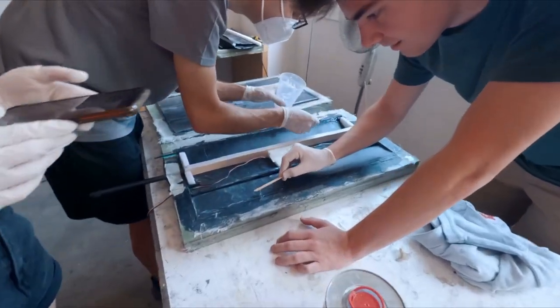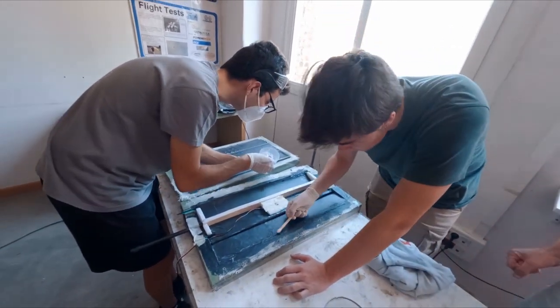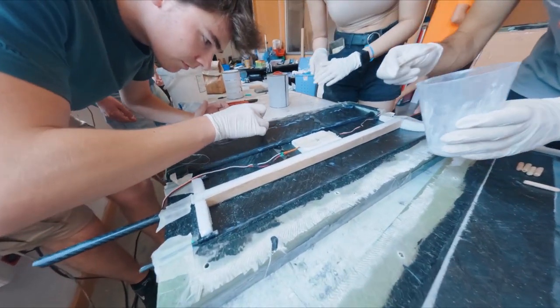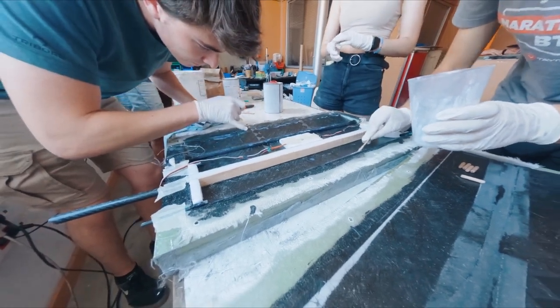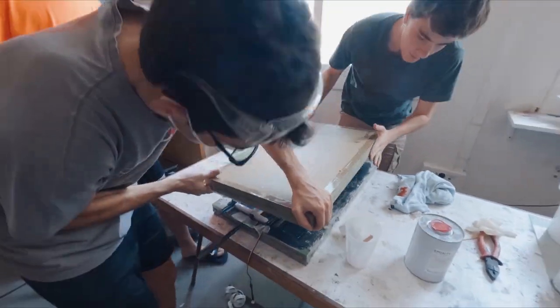The upper and lower surfaces have to be glued together. To do so, the spar core and some ribs have to be added in order to keep the structural strength of the wing. The main spar of the wing is made out of a composite sandwich made out of carbon fiber and wood, with the carbon fiber being embedded in the structural skin of the wing during the lamination process and the wood being placed at either side of the core nucleus.